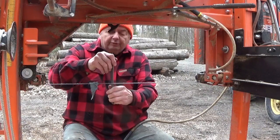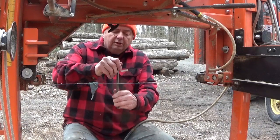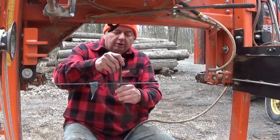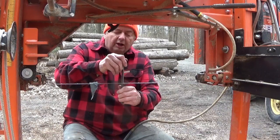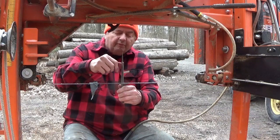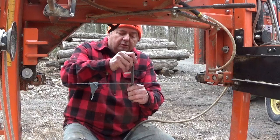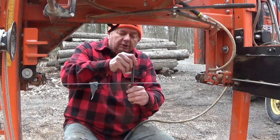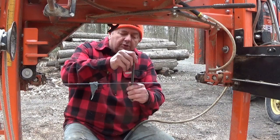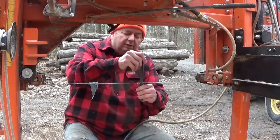You can see when I first go to start, and I don't know if you can hear it, but it's a little rough and hard to get going. You can hear a couple high tone cracks in the file, but then it gets like a nice easy cut. You see that? You'll hear those noises. Once you have the nice file sound, then you're done.